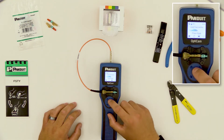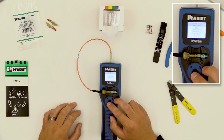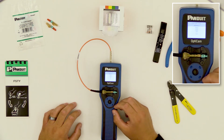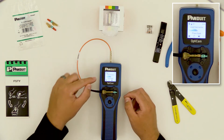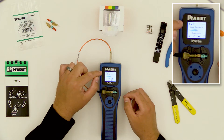If you've gotten that password successfully, simply go to the tool, the Settings menu, scroll down to Tool Settings, go to Wireless, and click On. If you're activating the wireless for the first time, that's where it'll ask you for that 6-character password. Since I've already activated the wireless on this device, I'm going to simply turn it on. Now when I go back to my main menu, you can see that the Bluetooth icon is now active — it no longer has the line through it.